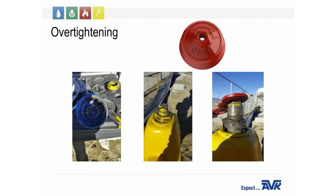Every AVK hydrant has an arrow on the top of the weather shield indicating the open direction. In these examples, someone tried opening an open-right hydrant by turning it left. In the first picture, they somehow managed to snap the stainless steel bolt holding the weather shield to the operating nut. In the second picture, they blew the inner O-ring out and stripped the threads on the thrust nut. In the third picture, they compressed the nylon washer so much that it pushed itself down around the outside of the operating nut. They also snapped the brake coupler. After the hydrant was repaired, they admitted to trying to open the hydrant the wrong direction with a cheater bar.